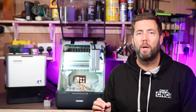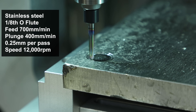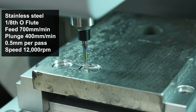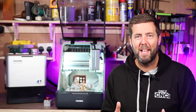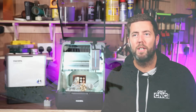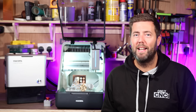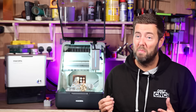Can it machine steel? This is not targeted to machine steel — it is for the softer metals, and I wouldn't be purchasing this solely to machine steel. However, I was curious myself. After doing a successful job machining copper, I swapped the plates straight out, put a piece of stainless steel in, and ran the exact same job. I wouldn't recommend doing that — the feeds and speeds should have been adjusted accordingly. It did actually start to machine it, but ultimately the bit went blunt and it ruined the bit itself. So yes, it did machine steel — but would I recommend it regularly? Absolutely not. It is not targeted for that, but those were my results.